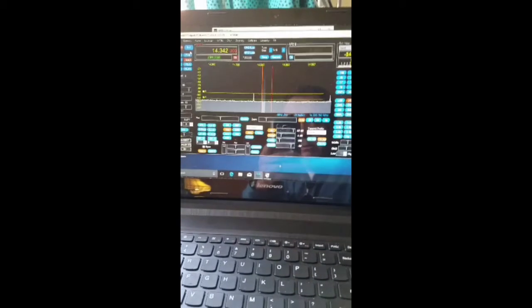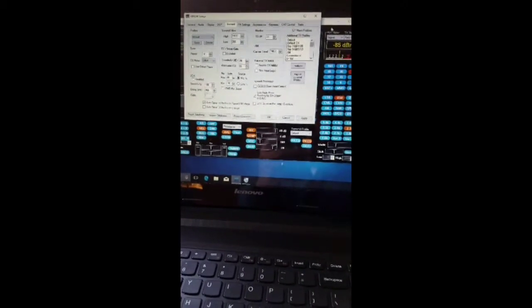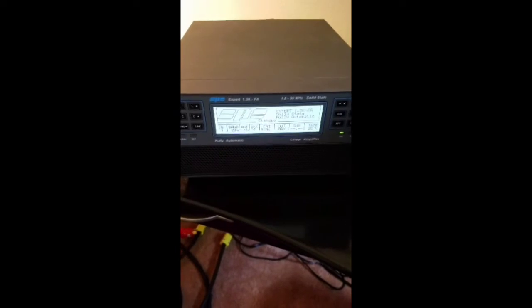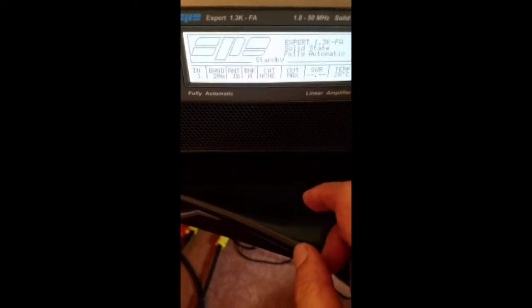Here's the software skin for this particular setup. I'm going to double-check that we don't have too much power — I'll reduce the power to about 14 watts so that when we're in tune, the power level can't exceed 14 watts, which is just a good safety measure. With everything off, I hit the tune button, and the SWR on this antenna is 1.8 to 1. Let's see if the automatic tuning unit actually works and improves on that number. Before we do that, let's go ahead and power it on. We have to do one setting here to take bypass off the unit, and we're up and running.